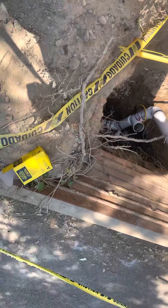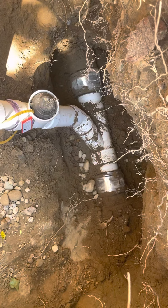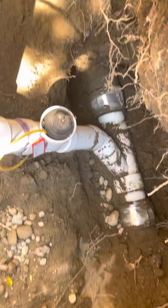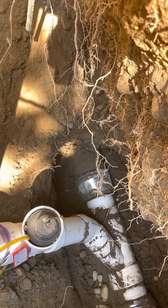You're looking at their tie-in? Yeah. The fittings are okay. But the fitting looks okay — it's hard to tell sometimes. Well, what they should do is dug this out bigger, more deep. Because honestly, if I show up for an inspection and someone's digging this — I have the right under this, the city engineer under her authority — I can shut this job down until they put shoring in here.